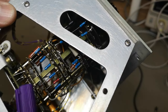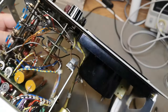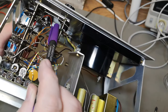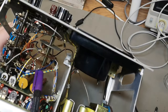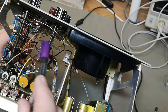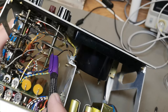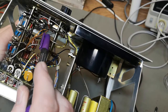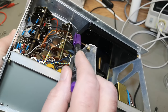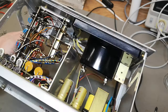Look at those high-quality precision resistors, and that is the deck they're using for all the switches — just look at that. The extra big distance avoids all sorts of unwanted couplings, and there's even a shield plate here. The wires are carefully connected. You've already seen it can easily measure one picofarad — so it's definitely no joke to make this.